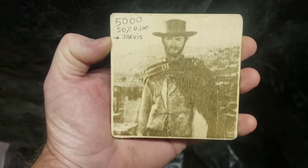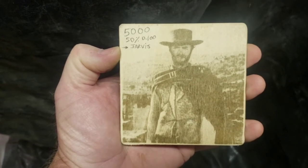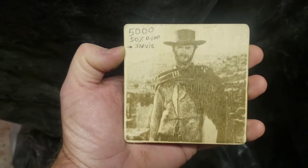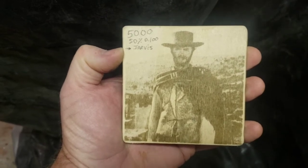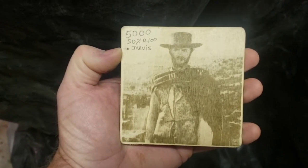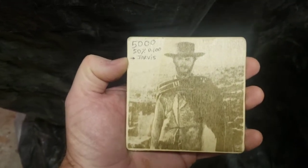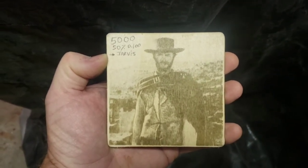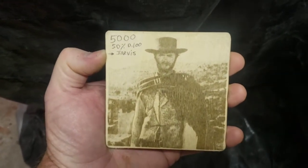When cutting vertically on the Y axis, it has a little more power just by the way the beam is focused than if it cuts on the X axis. So if you're cutting on the X and you really like your results, and you switch to the Y axis at 90 degrees, you might have to drop your power two and a half to five percent. Or vice versa, if you were cutting on the Y and liked your results and switch to X, you might have to add two and a half to five percent power to keep the same image quality. Then I'll do the brush test, slap a layer of matte clear coat on, and see how the image holds up.